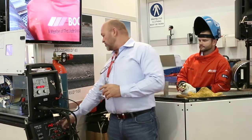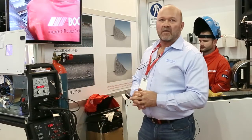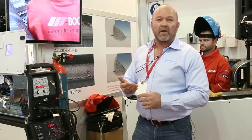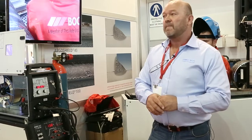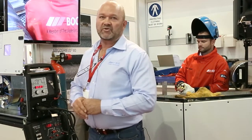And in conjunction with 130, 140 amps here on the tungsten arc, we can produce a far better weld, a faster weld — up to 100% travel speed quicker and 60% deposition rate higher, which results in cost-saving and cost-reductions.